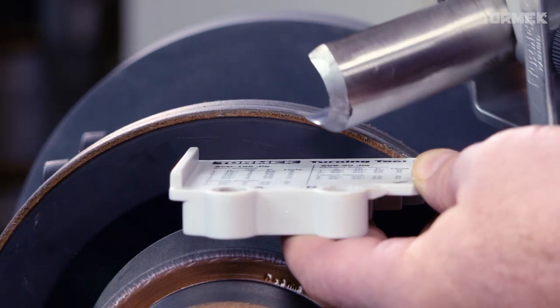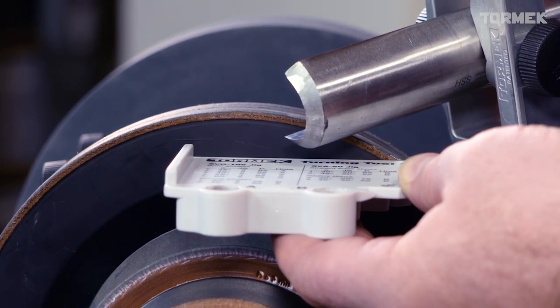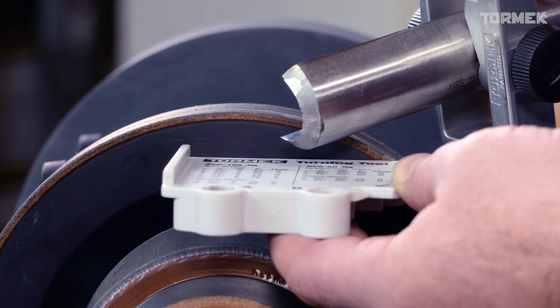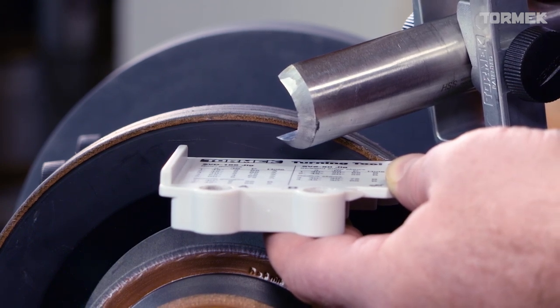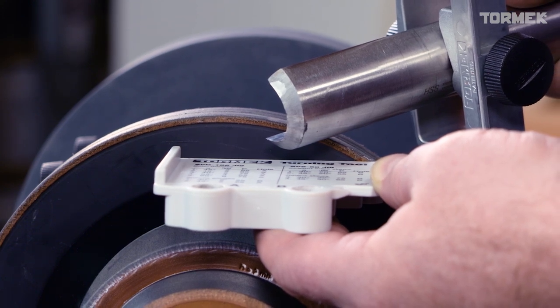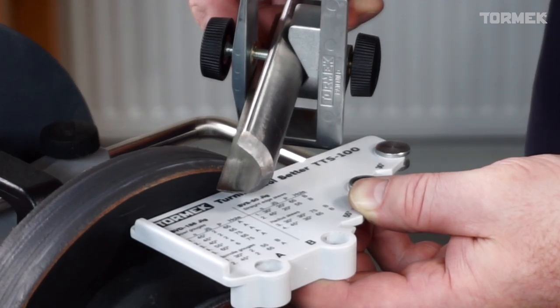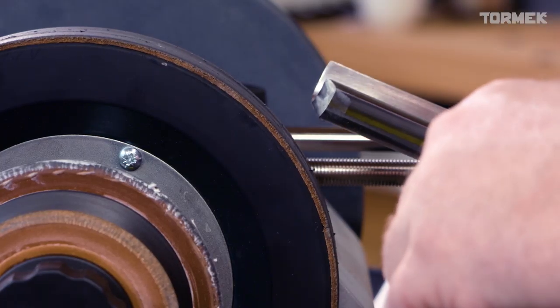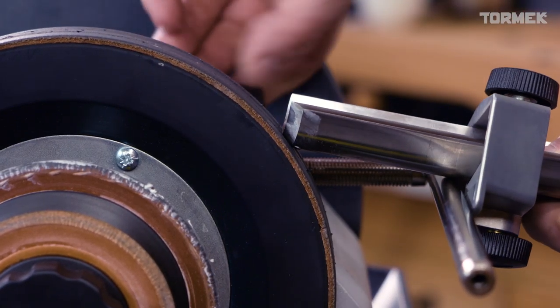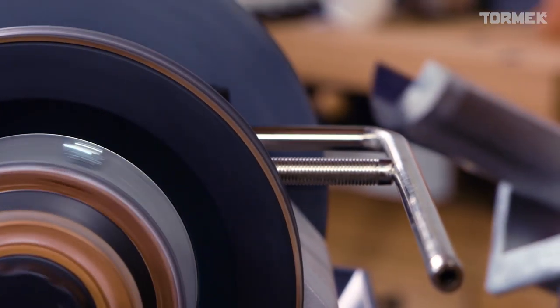The angle on this one is currently 45 degrees. We're going to hone it because it's necessary to have the best sharp edge — it's going to take quite a beating against the side grain, rough edges, square block, or maybe even tree trunk material. Now we're going to hone it and make sure the bevel is rubbing on the leather wheel.